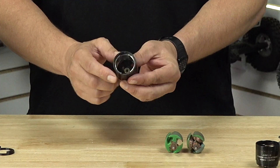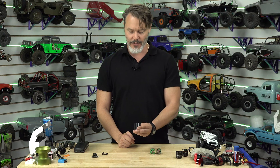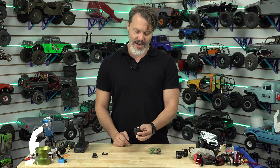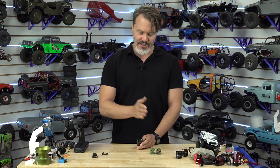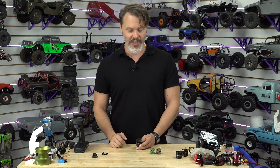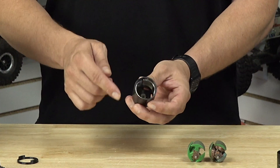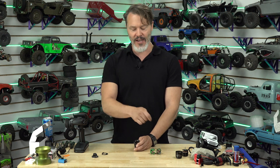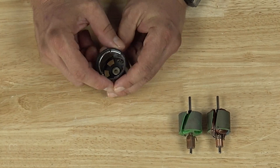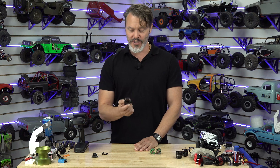The next version I did used actual magnets as spacers, and those magnets helped create a Halbach array — not a complete Halbach array, but still better than nothing, and it worked pretty well. But magnets themselves don't have good precision; the way they're made it's about ±0.1mm or ±0.05mm. In terms of a motor that should behave the same on startup across a batch of 100, there's going to be a lot of variation. Not only is there variation in the spacer magnets, there's also variation in the actual magnets themselves, and that meant there was always a little play or they just didn't fit.